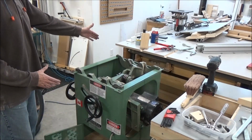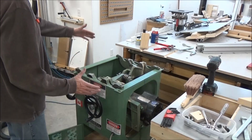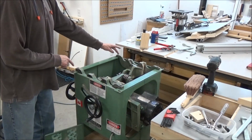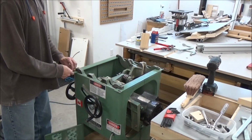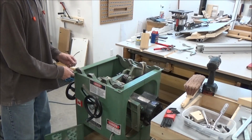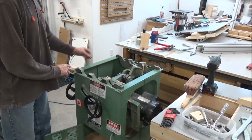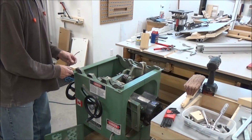Okay, as I looked at my table I just set down, tabletop, and you swing it back the way it goes back on, there were 2 shims, one on each side here. Then this one was from this side. So I've got a total of 80 thousandths here and 30 thousandths back there.